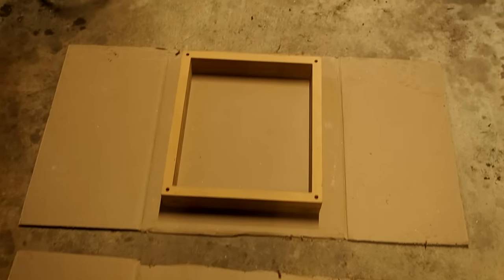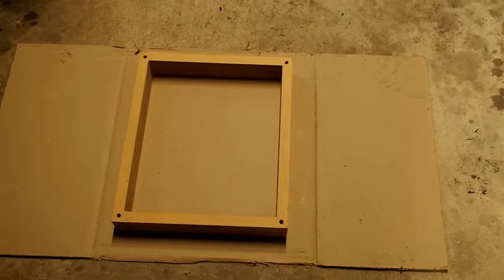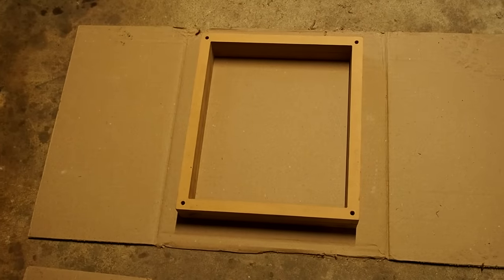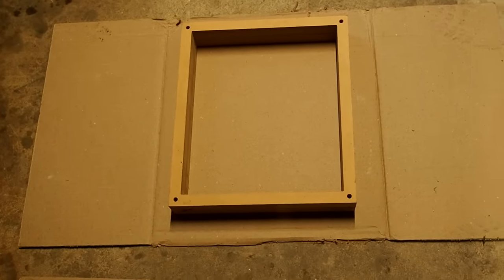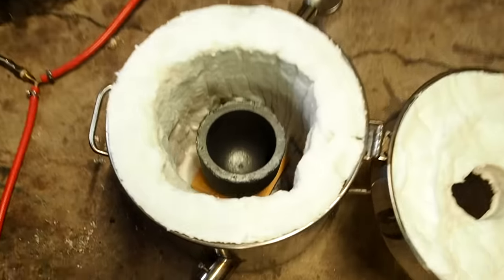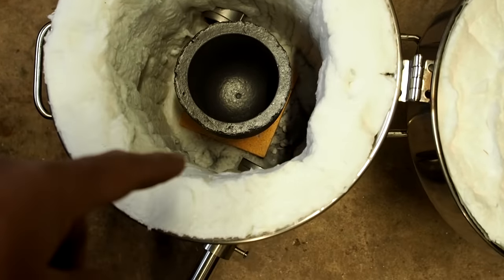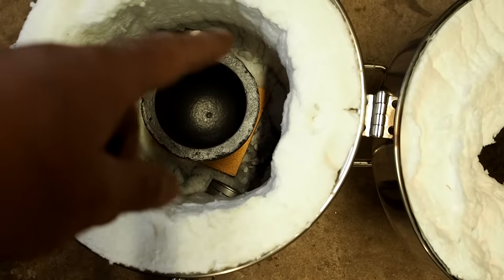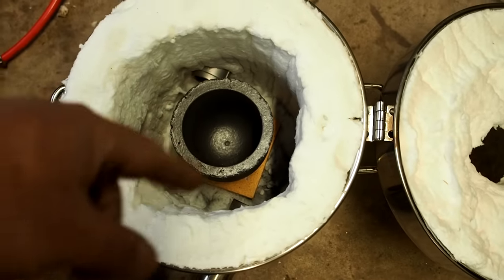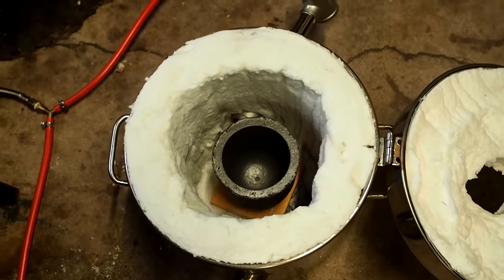So what you're looking at right here is 1/2 of a flask. It's two pieces that go together. One sits on top of the other one, and you make your mold for your liquid metal or bronze or aluminum to be cast or poured inside. Here's the foundry right here. This is a graphite crucible or a cup. We have gas flames going to come out and go around here. It's going to meet this one and go around in a circular fashion like this. Heat this bad boy up to 2,000 degrees and melt my copper and create bronze.